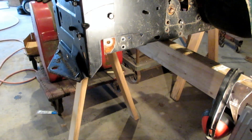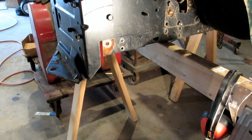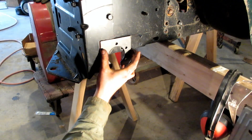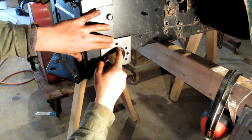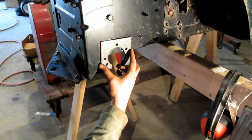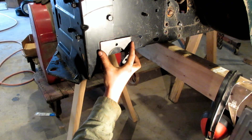I've had another slight change of plans. Instead of finding something to fill the gap, I actually just sliced this back section of the frame off so I can just place the bracket right in there. I've mimicked the same thing on the other side. I just have to now carve out the half circle from the main section of the frame and then weld it in there nice and solid and continue on.